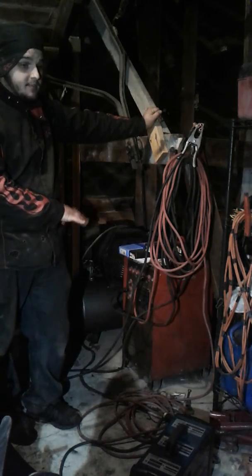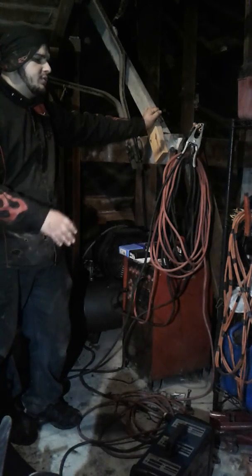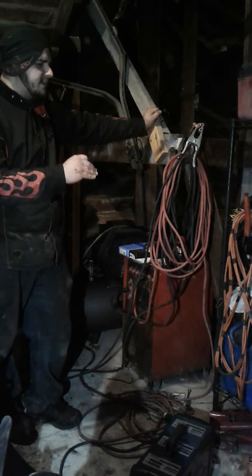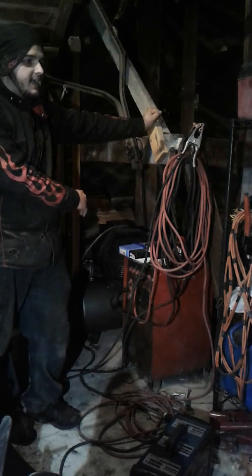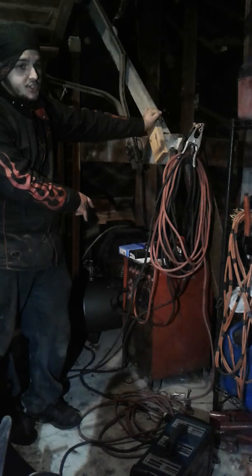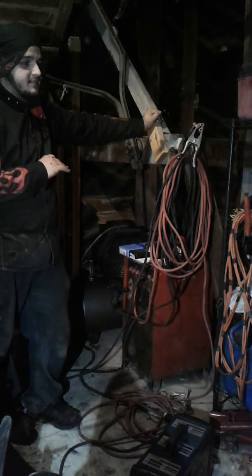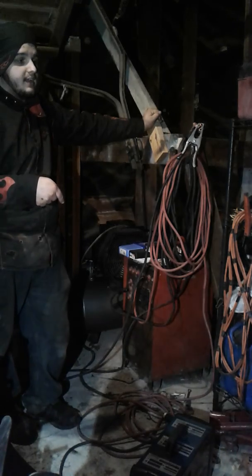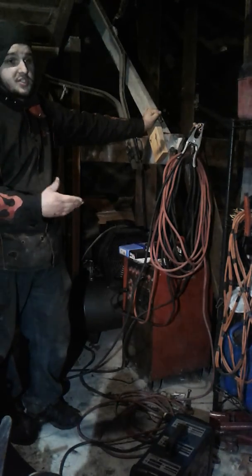As for the characteristics between DC and AC welding — DC gives you a more smooth, steady arc, just nice. AC is a little more violent since it's oscillating about 60 times a second, a bit more spattery. That said, AC does start an arc a little easier. I had some people over and they actually preferred the buzz box transformer machine over the DC machine for that reason. One of them held a long arc and just warped the plate. With a DC machine, holding a long arc causes it to go out immediately, which is actually good — you should always maintain a nice tight arc.